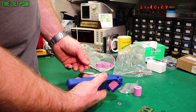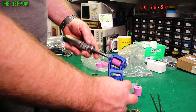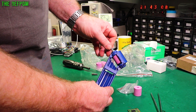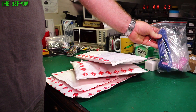It's not got a shoulder, so I wonder if this washer should be on the other end. Now I put the washer on the other end instead — it spins freely now. That's how it's supposed to be — it had been put together improperly. It might even need more washers, because it looks like it's offset a bit. I've also got a little spanner with another nut and washer as a spare. Drill sharpener is a bit cheap and nasty — quality is not that great. But it might be good enough to do the job. They are really cheap — probably five bucks or something.